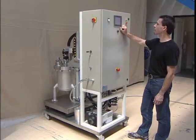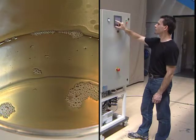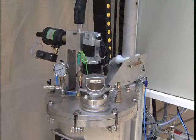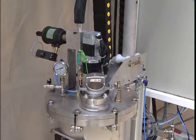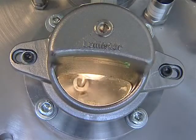Mild heating of the resin must be maintained throughout the process to avoid the resin turning exothermic. For this purpose, the tank — the main item in the machine — is fitted with an internal heating system and the temperature is continuously measured by a probe. An electric motor provides continuous stirring of the resin.